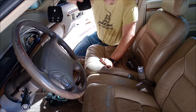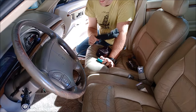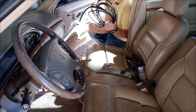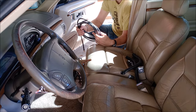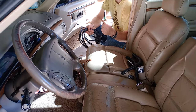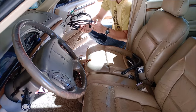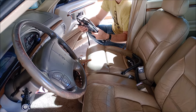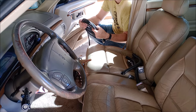Let's go ahead and take the fuzzy dice — we'll need those. And I've got my Oldsmobile hat that we'll put in my 71. There's the coax cable that I wanted. I got it from a ham radio store and it's high quality. I used to be able to do connectors, but not anymore with my essential tremors. Is that a PL-259 on that end? Make sure you use 50-ohm cable for your radio, battle. Don't go to Radio Shack and buy 75-ohm cable or you're going to be hurting.